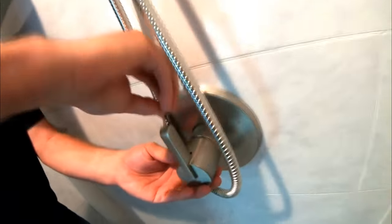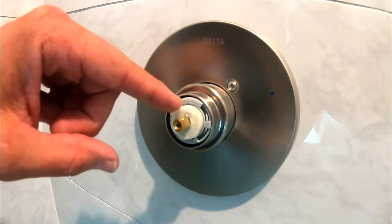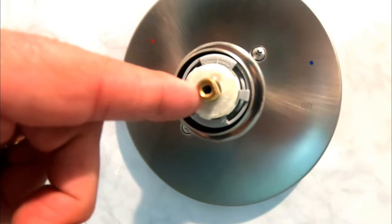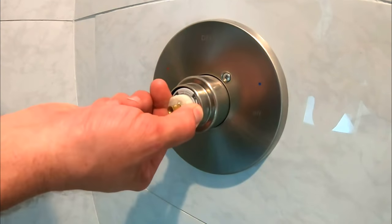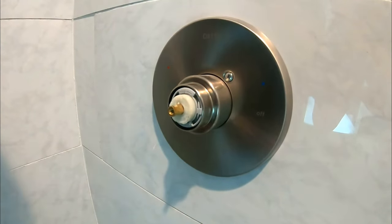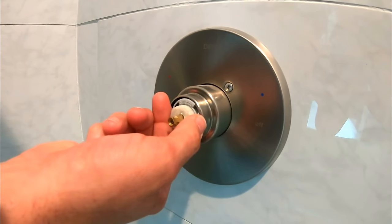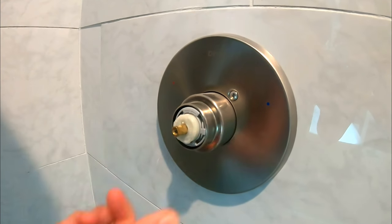If you can read that, it says hotter to the left and colder to the right. On the white part of the valve it says pull out and turn to adjust. We want hotter water, so we're going to pull it out and then turn it. We're going to go halfway and try that — a quarter turn is all the way. We were originally right in the middle and it was just lukewarm, so we'll split the difference and see how that does.